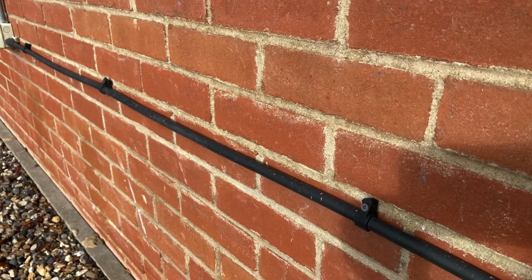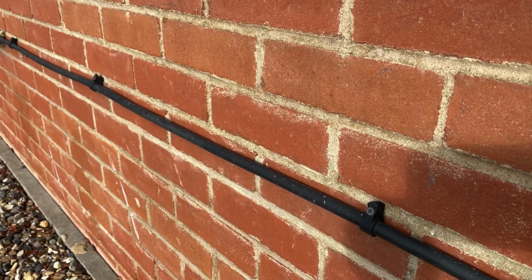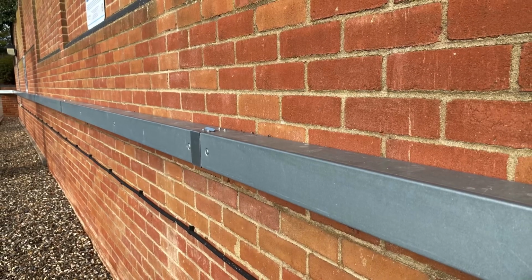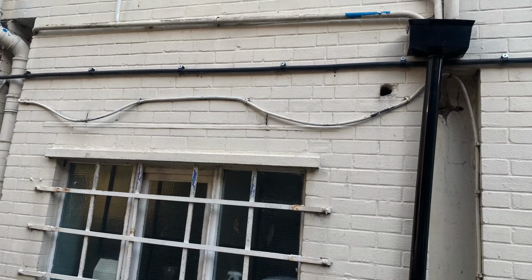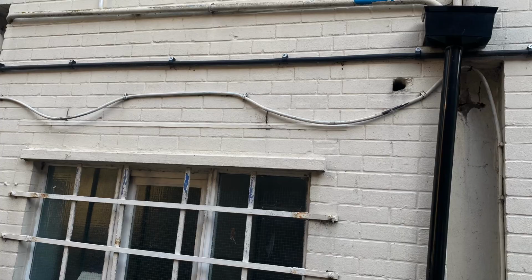In this video, we're going to look at the maximum spacings for supports for steel wire armoured cables in accessible positions. We've all seen it before on the outside of a building, and even more so now with EV charging. An armoured cable clipped using cable cleats, and when it's done correctly, it looks super neat, but we've also seen examples when those supports are less frequent than they need to be and the cable starts to sag.